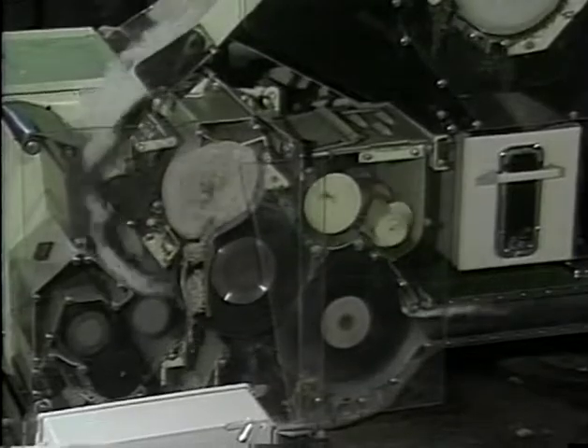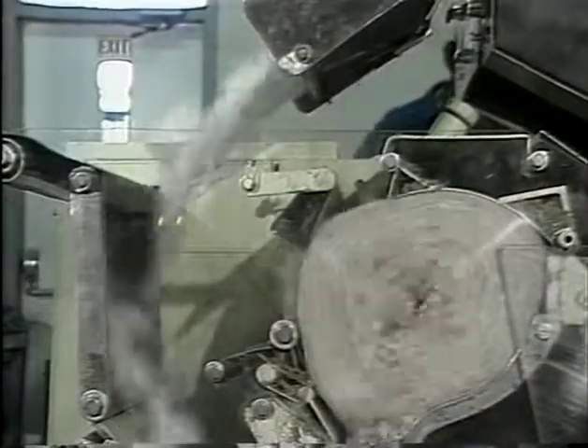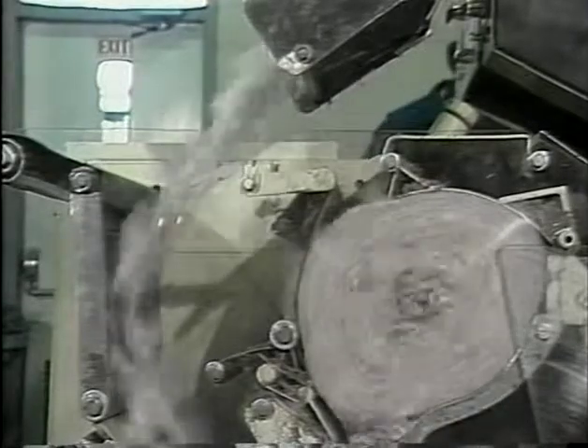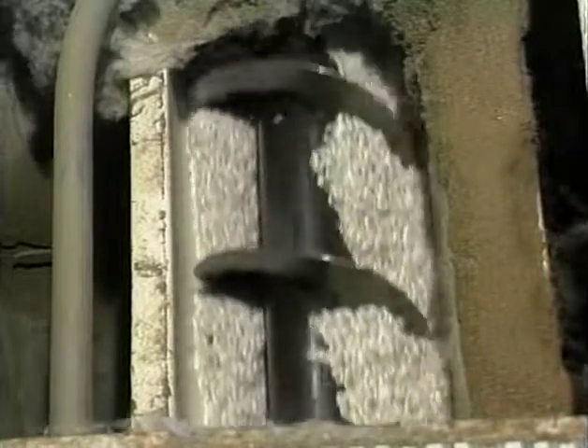The gin stand is the heart of the system — the machine that actually separates the seed from the lint. On traditional saw gin stands, seed cotton entered the roll box through the huller front, the final stage of seed cotton cleaning. The seed cotton is plucked between huller ribs into the roll box. Recent super high capacity gin stands do not have huller fronts. To accomplish the actual separation of the lint from the seed, the gin saws which run between the ginning ribs catch the fibers and pull them between the ribs, which are spaced too close for the seeds to pass. High speed photographs show that the fiber is pulled from the seeds in tufts, and only part of the saws are loaded with fiber. When the seeds are cleaned, they slide down the face of the rib, fall out the bottom, and are transported to storage outside the gin building.